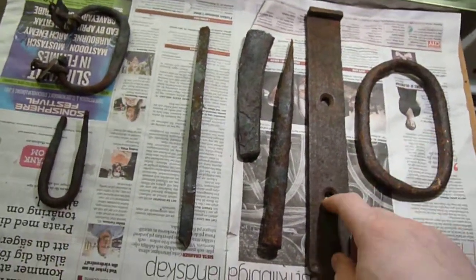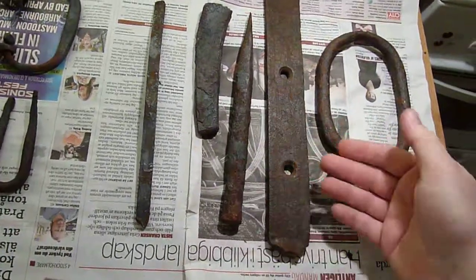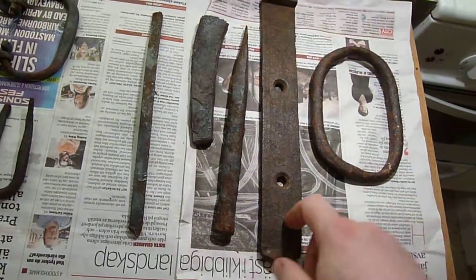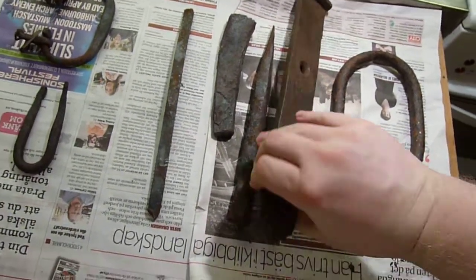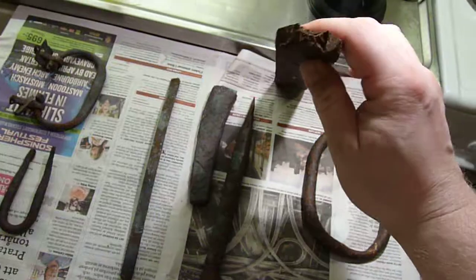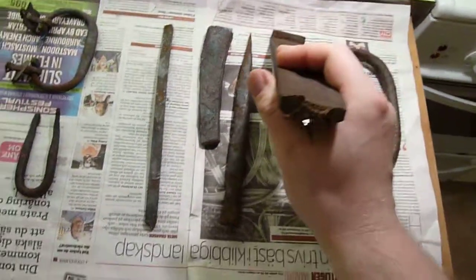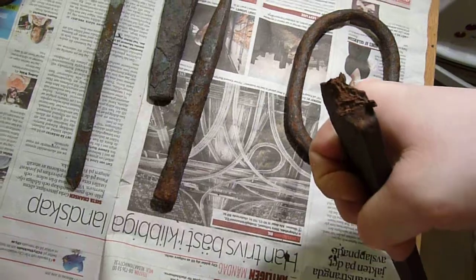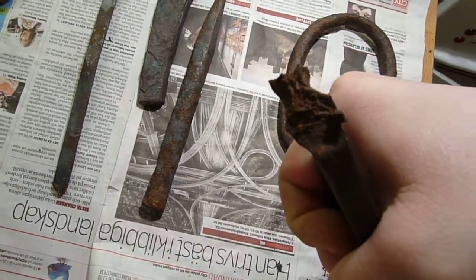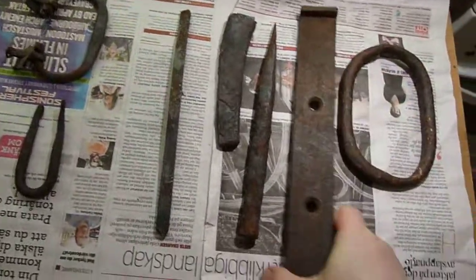The first test to do here is to see if it's got layers. What you usually do is cut halfway through and then bend it so it breaks, and you can see if it's got layers. But this is already done on this piece. You can see that it's got layers in there - it's flakes in layers.